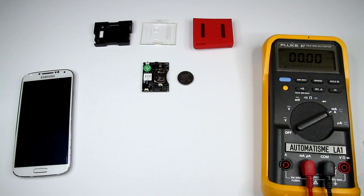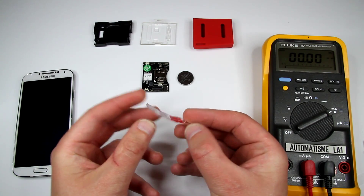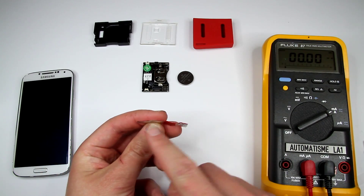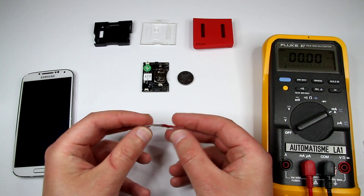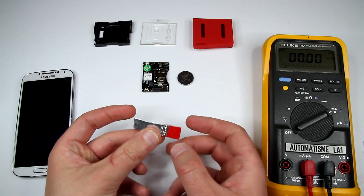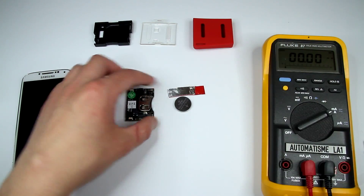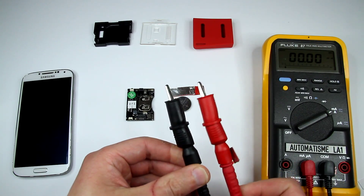In order to do that I made a little contraption — I call it a two-sided electrode. It's electrical tape in between two aluminum tapes, and both sides have insulators for alligator clips. I'm planning to insert this between the battery and PCB and measure the current using my Fluke multimeter with alligator clips and probes.